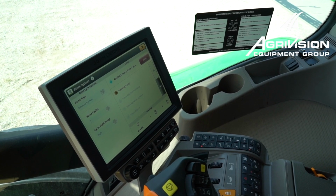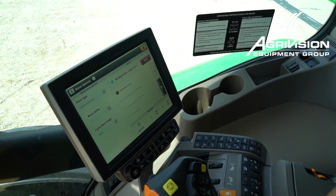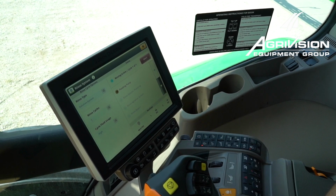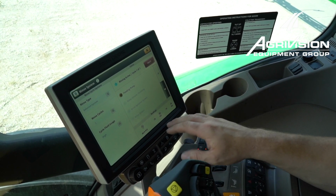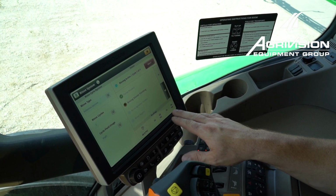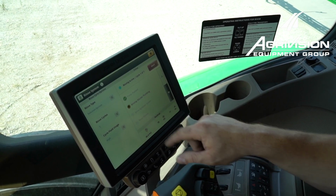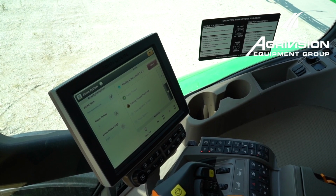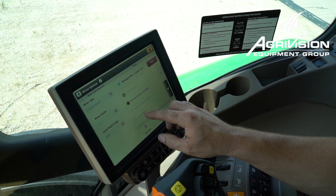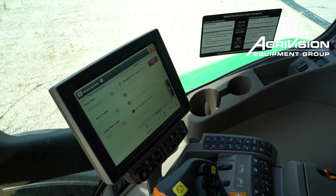So right now it's pulling the RV antifreeze into the pump from the rinse tank to the main tank, and then it'll step through this process. You can watch your screen down here below and see what our solution pump pressure and our boom pressure is. And then as it gets through each step, it'll check it off. It may take a little bit, and we can come back and show you once it's complete. Right now it's rinsing the agitation system, as you can see on the screen.